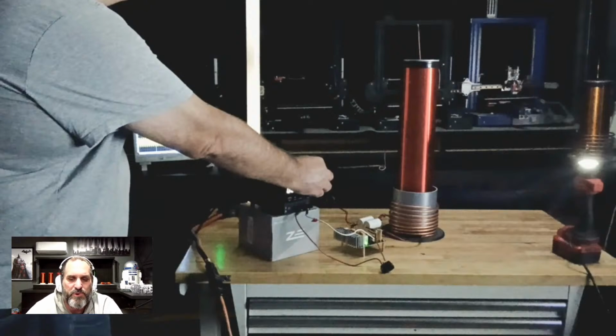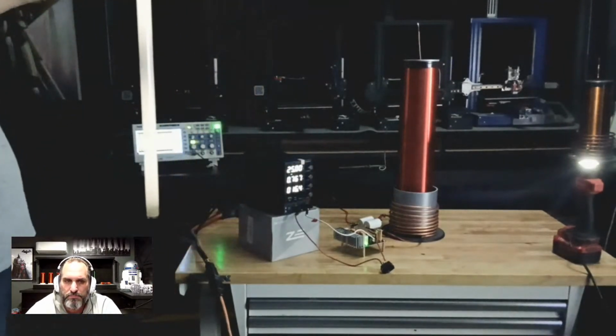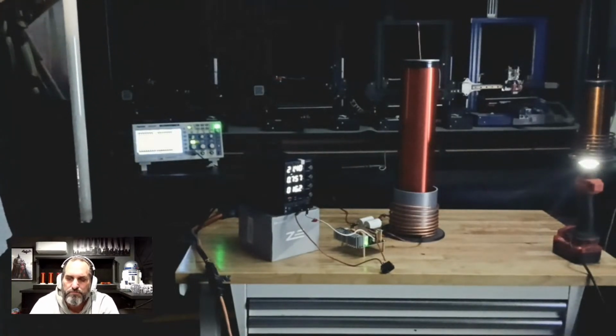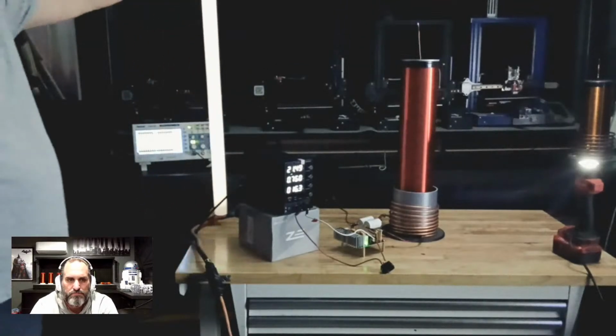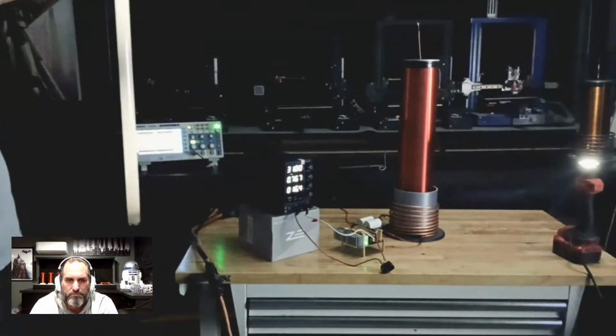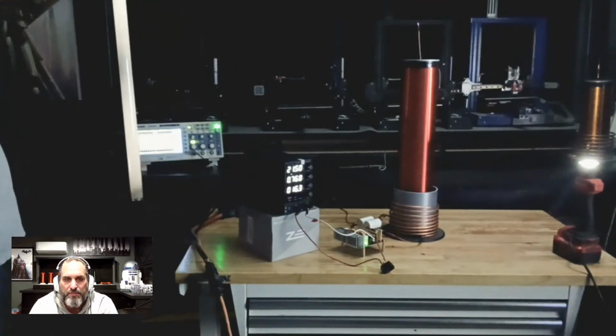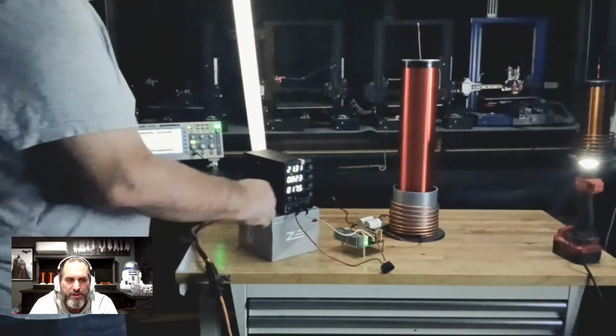But you can see in this test right here, what I'm doing is checking the DC on it. This is close to the same frequency. We're 10 kilohertz different than the other one. And I wanted to do it in 28 gauge instead of 32 gauge. So it changed the size of the Tesla coil quite a bit. This one's closer to 2 feet. The other one's closer to 1 foot, but it still pulls a good distance there. I mean, that's not bad for what, 30, 20 volts, whatever it says on there. That's pretty good.